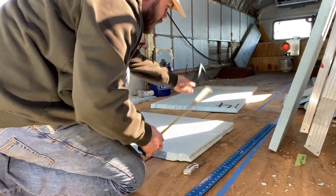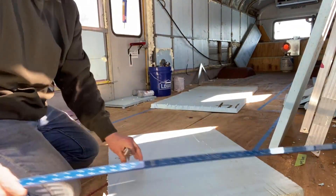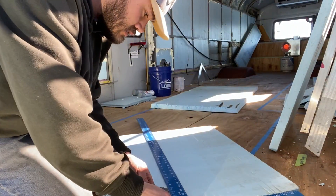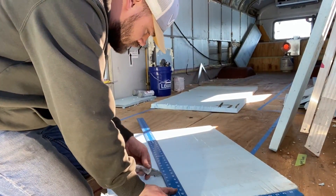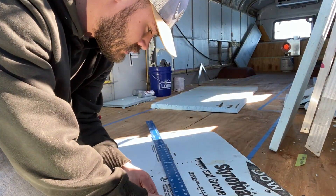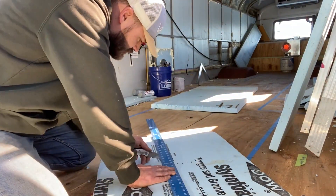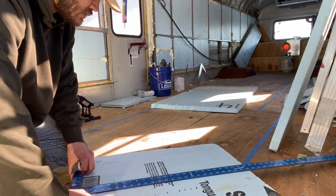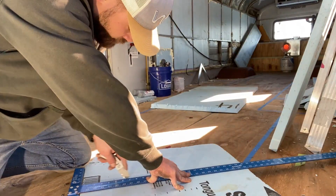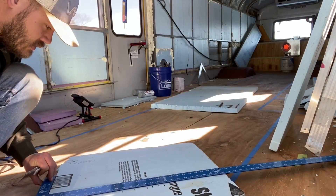So now we're 25 and a quarter wide. We're going to lay scores on here at every three inches, out to 18 inches. So — three, six, nine. I'm going to get picky and put our score marks on the lettered side, so we can have the non-lettered side facing out. We're just going to hit all of our scores now. We don't need to hit it the whole way deep because it's going to fall about halfway through. Just keep making cuts.